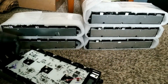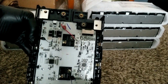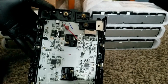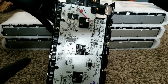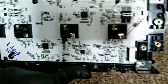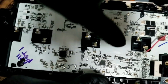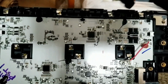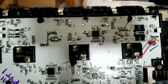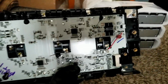And you have the positive and negative terminals on each end right here. They all interconnect. If you want to deal with this battery, it's just a matter of taking this PCB out. You cut the temperature sensors that are incorporated with it, since they have nothing to do with this, and you see the layout. Then you can just wire your BMS into that. Go to the battery minus, the black, then B1, B2, B3, all the way to B16. And that's how we're going to do it.